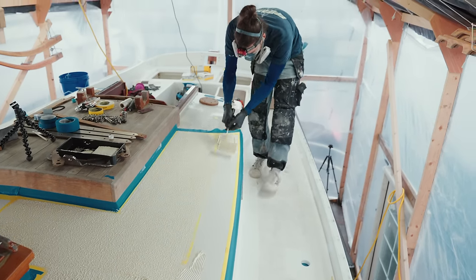Be very careful when there are two pieces of tape because you might be pulling, but then the tape separates there. And if you have a piece of tape falling onto the fresh Kiwi Grip, that changes the pattern, of course. But what I also liked is that it's pretty easy to patch up the Kiwi Grip.